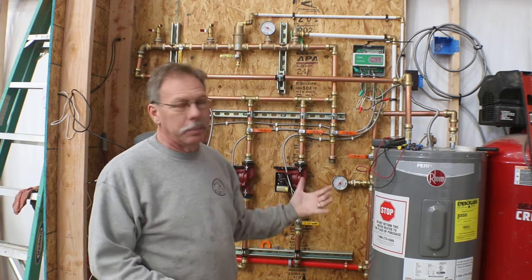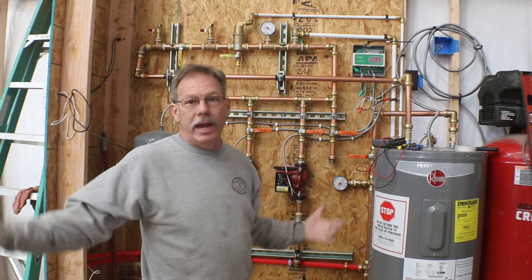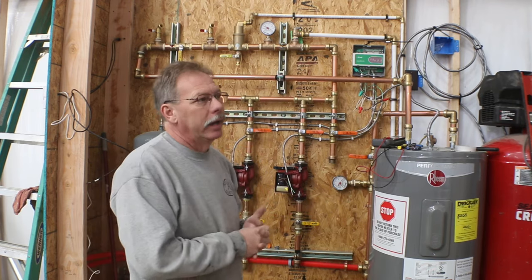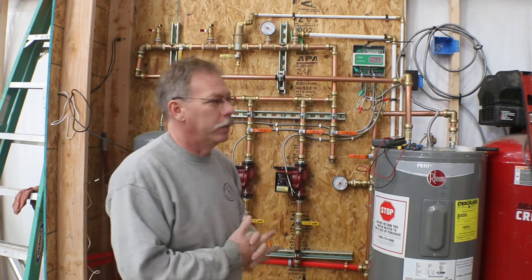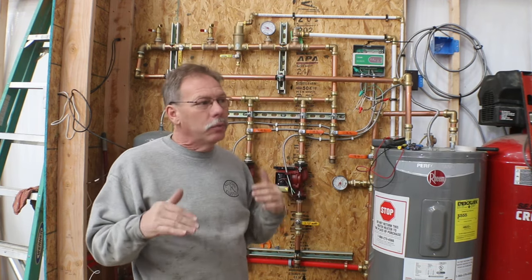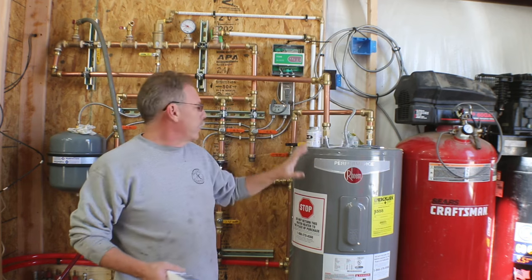Basically we've got to put 30 gallons of antifreeze in this system for an 80 gallon system to get the freeze point that I'm worried about. Our coldest temperature on record is -20, and I think that was like 15 years ago, but we do get some hard freezes. We're just in a time right now where we've got about 2 more weeks of pretty mild temperatures, and I'm hoping while that's the case, I can go ahead and get this floor up to maybe 60 degree temperature.